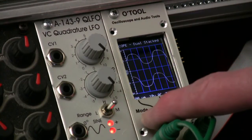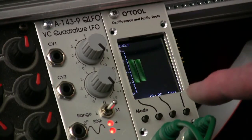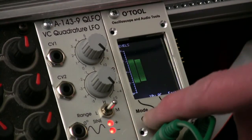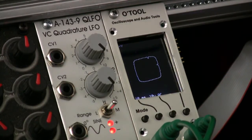These are the two sine waves on the oscilloscope, and these are the two sine waves on the levels. You can see the shading of the sine here more so than on the other one, because the shape of this sine is a different shape than on the AFG. This is the XY mode. You'll notice the little spikes that are moving around the shape — those are the spikes I pointed out at the top of the sine waves. So if there's something in the sine wave, some distortion, that will change the shape in an XY display.